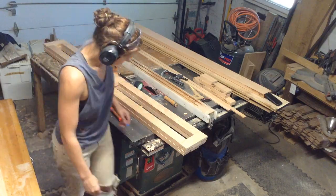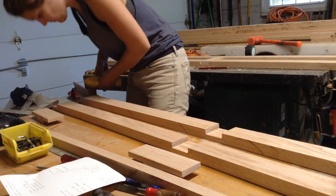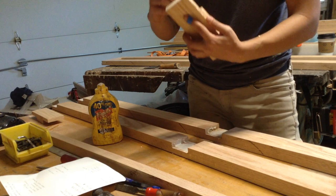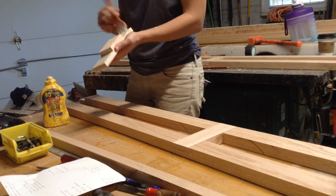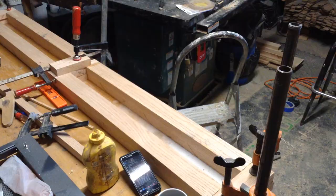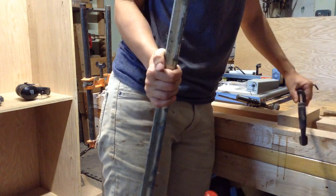At this point I'm going to glue this together, prop everything in place with the cabinets on top to make sure it's the right dimension, and then cut my sides. The nice thing about lap joints is the large gluing surface area — this glue is stronger than the wood. Anytime you can amplify the gluing surface area, it makes the joint stronger. You can also see the way this is designed: anything sitting on top has downward force on the edges, almost like a house where there's nowhere for those edges to go because they run top to bottom, as well as having that flange connecting the whole piece.